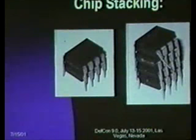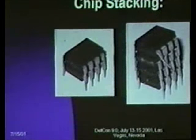Here's an example. One of the nice things is because they're both 8-pin DIP packages, they share power and ground pins, so you can do this little bug sex thing where you basically just stack them together. And in this case, to do what I want to do with it, I'd actually have to route some of the pins around with some wires, because this unfortunately puts one of the serial data lines on top of the Atmel interrupt line, which you want for the keyboard interface.